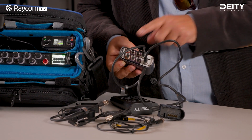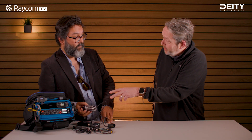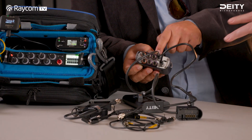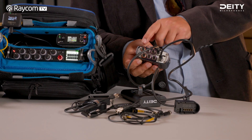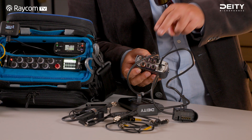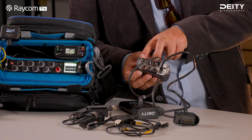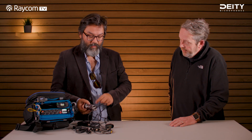Then on group two, all your accessories. So you can be running two two-amp outputs and two five-amp outputs — a total of seven amps per group. It can be a bit confusing, but the groups are rated for seven, and the individual outputs within group one are rated at five and two. But you can run a total of ten amps overall.